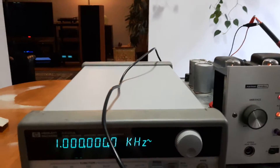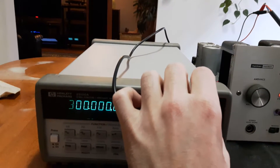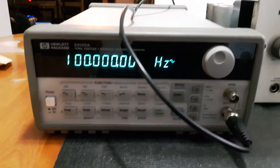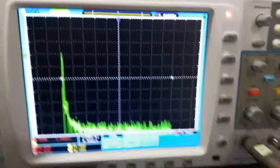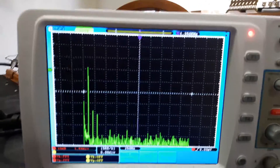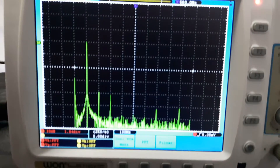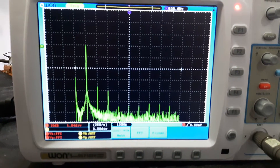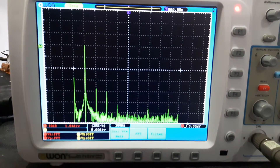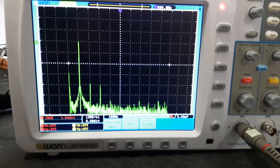So let's slow this down and we'll see how it responds at other frequencies. Let's bring it down to 100Hz. Just make sure that we don't have any of the filters off — perfect. There's a significantly greater amount of distortion than you would see with solid state.